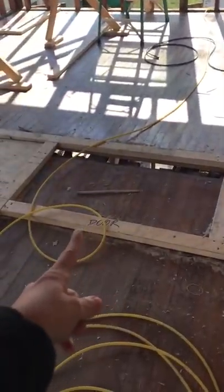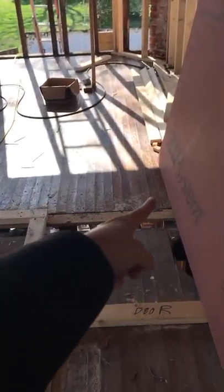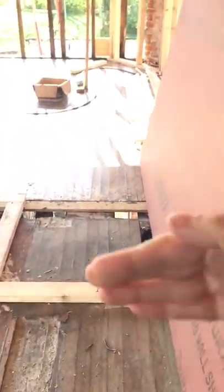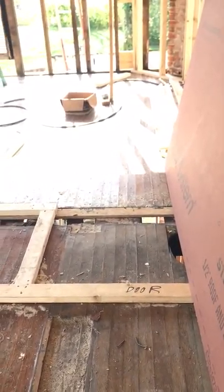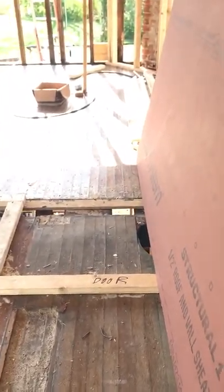Now I think it's actually about six feet eight inches where you'll hit this — and it's not really a wall, it's a door that leads to the back bedroom. This is going to be a door that leads to the linen closet. The reason we brought the door forward is that when you theoretically put a door on the bedroom rectangle and move the door forward, you get in-swing — meaning when you open it, it won't hit stuff in the bedroom. It basically buys you more room, and we think it'll look nice to have a big matching door here and a big door here — same size, great continuity at the top of the stairs.